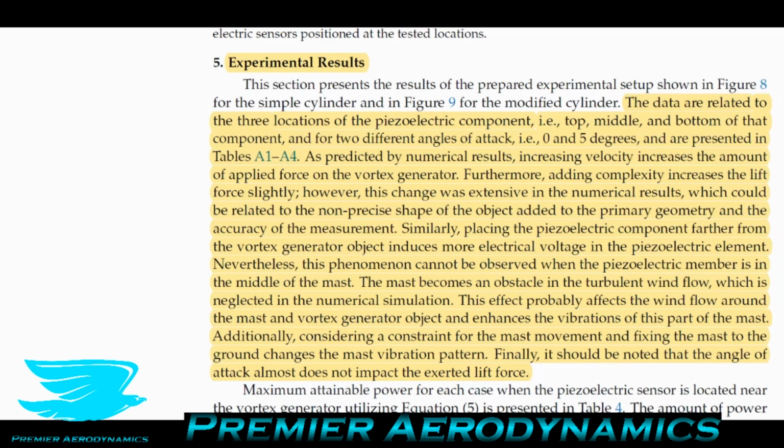But if you change the angle of attack, I reckon it might result in a lot more of a change, because if you have a beam and you change it so the direction with the highest second moment of inertia, so the highest stiffness, is in the direction that the lift is being generated in, it means that the mast is not going to flex nearly as much.